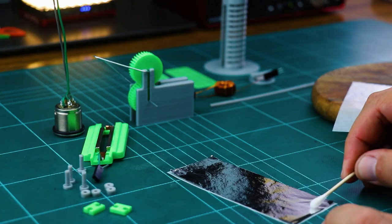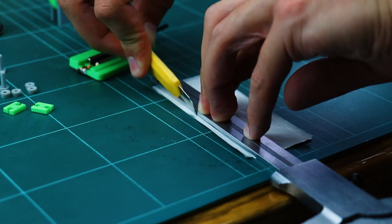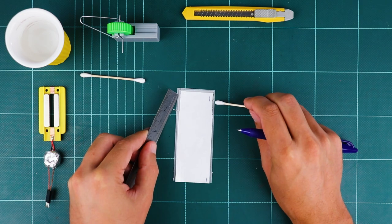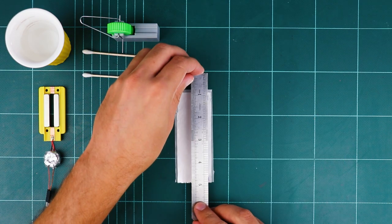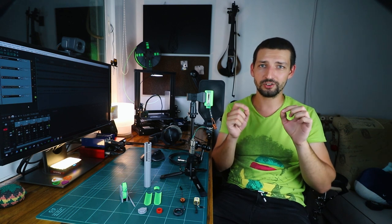To cut the ribbon, measure the effective gap between the magnets and cut an aluminum strip about 1 to 2 mm narrower. The Royer ribbon is cut on a dense 1 mm grid cutting mat, while you can mark the width on a piece of paper first and then align with the aluminum sheet edge. Before doing it for the first time, I suggest you try cutting and corrugating a stripe of paper or kitchen foil first to see if the ribbon width is right and feel how aluminum behaves during corrugation and tensioning.